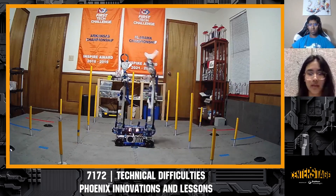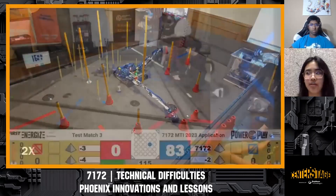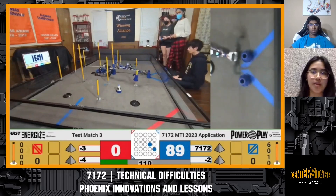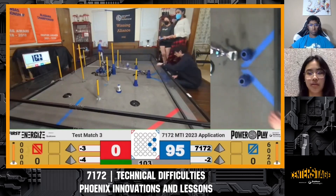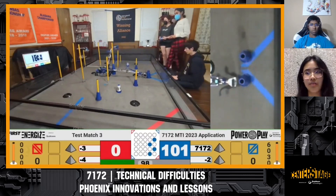On the software side, the arms have limitations and automations. To avoid the two drivers clashing together during matches, only one arm is allowed to pick up a cone at a time — unless it's the end game when both the cone and the terminal shipping elements are being picked up, which avoids penalties. So if one arm is picking up, the other cannot pick up a cone. That's pretty much the hardest coordination aspect of the two arms.